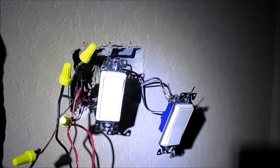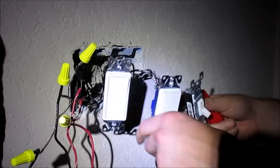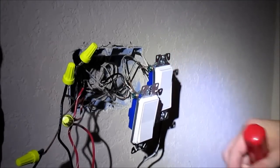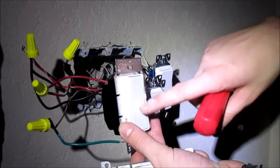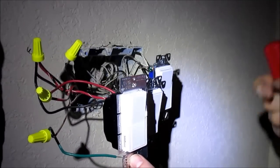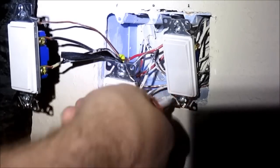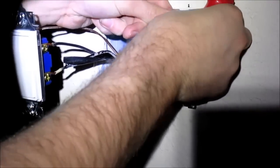You may notice that as you're putting in the screws it is kind of tough, so you will have to push through it with a little more force, but make sure you're avoiding cross threading. My exterior lights are the first switch, my entryway inside is second, and then my fan control lights. For the fan control light we do have to do a three-way switch because there's another switch I'll do in just a bit. After we finish the wiring we are remounting the switches and then putting the faceplate back on.